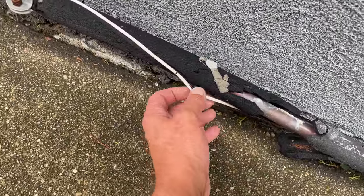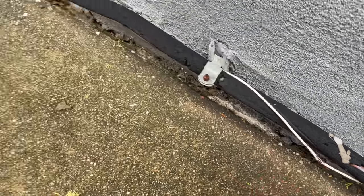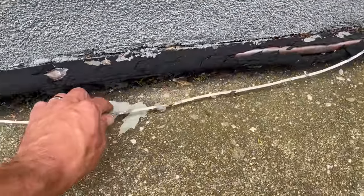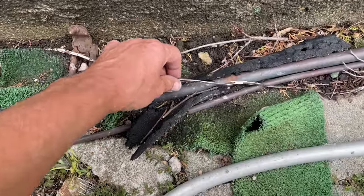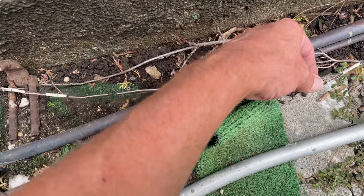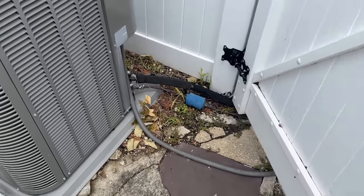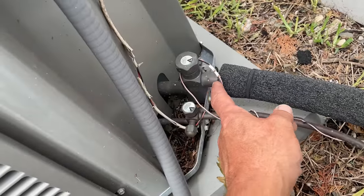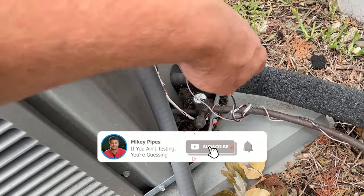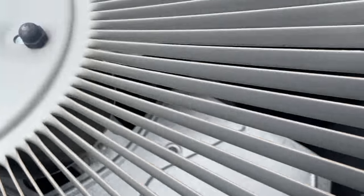She's saying that the unit is not coming on - the outdoor unit isn't coming on. The line set is all frayed, missing all the insulation. But if the indoor fan is blowing, then we didn't blow the fuse yet. Let's see if we hear the contactor pulled in - which we don't. And following the wire here, there's a pressure switch right down there.